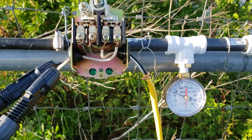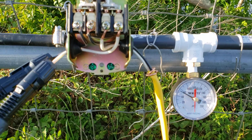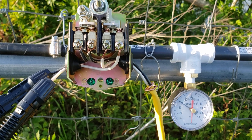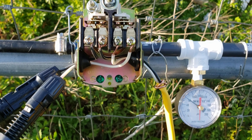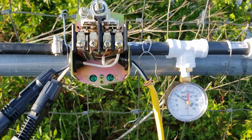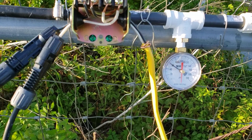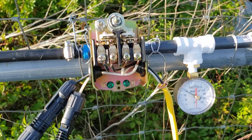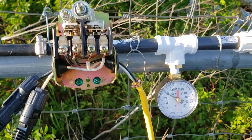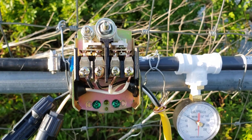So I'm going to hold this panel up in the air to get more sun — and there it goes, the pump's running again. It's getting close to 60. I want to show the pressure gauge — watch when it hits 60. There it goes. So now the solar panel and the pump have been disconnected because we hit 60 PSI. As soon as that water valve up there kicks on, it's going to let that rush of water and pressure through the timer and quickly drop the pressure on this gauge, which will repower the pump and let it go again.